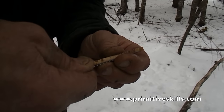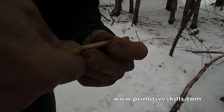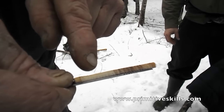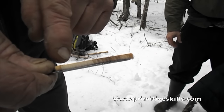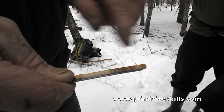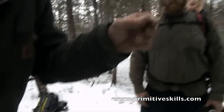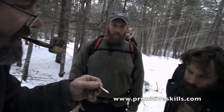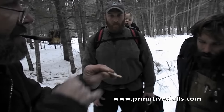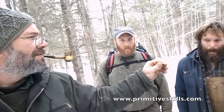You can see where the heartwood and the sapwood changes. There's a pretty good look at the growth rings right there. This is actually a pretty decent tree. The growth rings are easily distinguishable and none of them are thin enough that I wouldn't use them. Every one of these growth rings is valuable because of the width. I can see a riser and a weaver in every one of them, right down to the end. That's just a cross section of the growth rings.